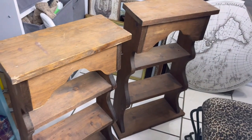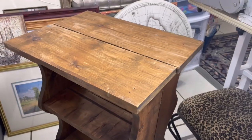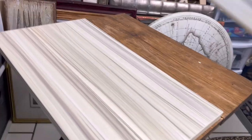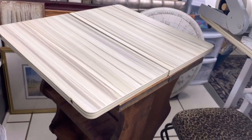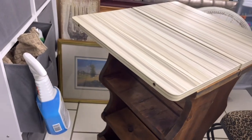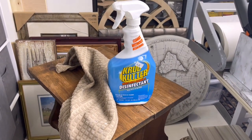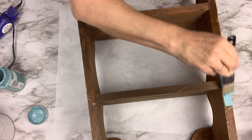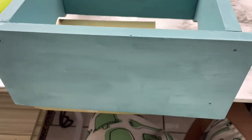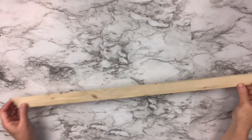This was a really fun experiment. I basically thrifted these two shelves from my mom's house — she had them but wasn't using them, and she needed a little table to hold a smokeless grill. My idea was to put the shelves together and put a surface on top, creating a little table with shelves underneath. I had two extra pieces left over from a desk I assembled that I didn't need, so those worked perfectly as the top surface. I clean it off with Crud Cutter — it had been sitting in her apartment, very dirty and dusty — then I take my Agave chalk paint from Waverly and paint the whole thing, just one coat so a little wood shows through to avoid distressing.